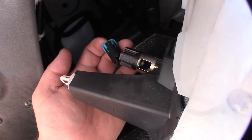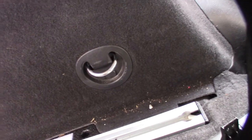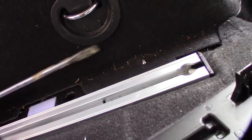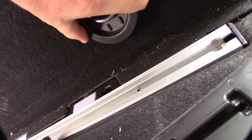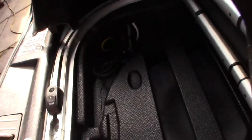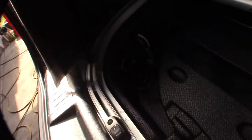Remove the power plug first. Take off that little blue skirt right there — get a screwdriver in there and squeeze, that should pop out. I used needle nose pliers. There's no information on this, so note: you have to get the blue thing out first because it prevents the connector from releasing. These hooks are securely fastened to the body, so get a screwdriver from the bottom and pop it off. You can see the two hydraulic hoses running down here.